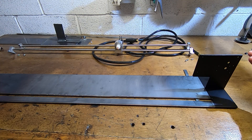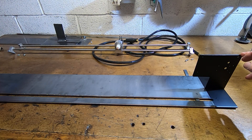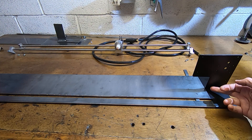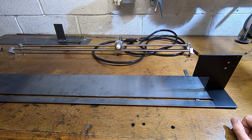I started the plates forward about a millimeter, which is about what I expected them to move by, and sure enough they ended up almost completely vertical. They are within about 0.1 millimeter top to bottom from being perpendicular to the base plate, so that worked out fairly well.